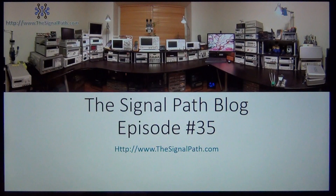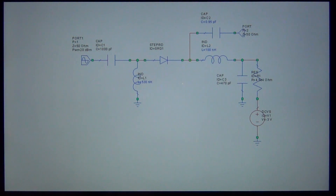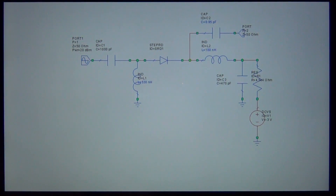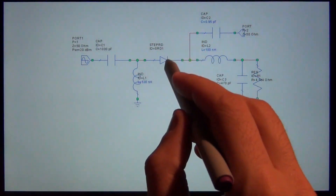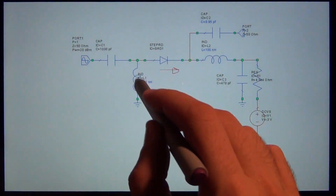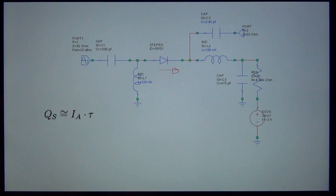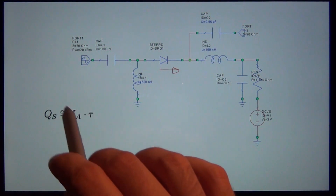Let's talk about the principle of operation of this instrument. I want to tell you how this unit actually works. I'm going to introduce you to a specific type of diode called a step recovery diode, designated SRD. The interesting thing about a step recovery diode is that it can produce really, really sharp pulses. It does this via the principle that the diode is first forward biased — current flows through the diode — and once a sufficient forward bias current has passed through, the junction capacitance inherent to the PN junction is charged with a certain amount of charge Q, approximated as Q = I × τ, where τ represents the transit time of the charges and I is the forward bias current.